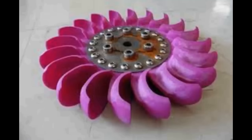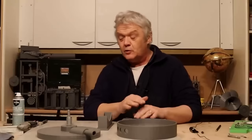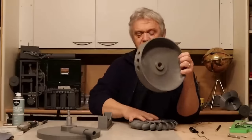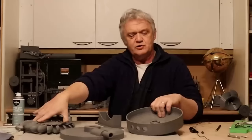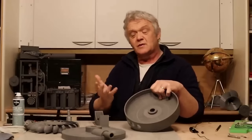The turgo turbine is a development of the Pelton wheel and it's very efficient. So I turned to Tinkercad and drew up a water motor based on the turgo turbine - this is a work in progress, but I'll put it on Thingiverse. The heart of this device is pretty straightforward - really these five bits: the turbine, the housing made out of this bit with the turbine slotting in, the housing top, and a foot as a drain. All we've got to do is put some bearings in here, a piece of 8mm rod, and glue it to the foot.